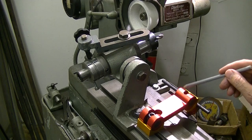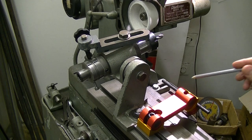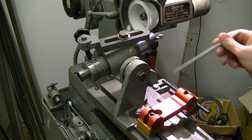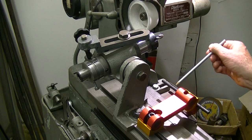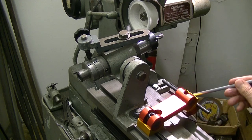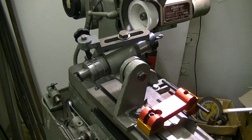I've been looking at making a table stop for the Clarkson because they don't come fitted with one. I remembered I bought one of these very fancy American pattern milling table stops, so I've set it up. It works reasonably well — it's a bit fiddly to adjust, so I'm going to fit a thimble micrometer style threaded onto the end of the rod, which will also make it adjustable for milling work. It threads off the table up against one of the Clarkson brackets that holds another indexing finger. It's a very adaptable grinder — you can do a lot of things with it, but a very small work envelope is my main complaint.